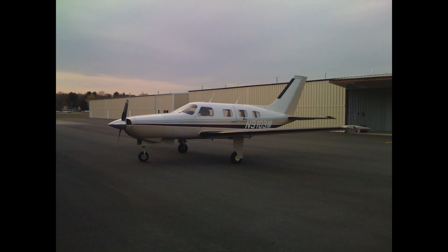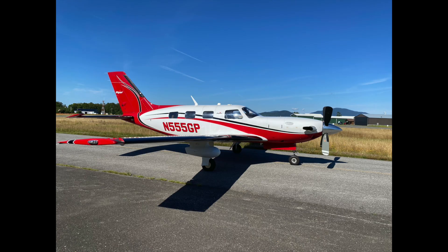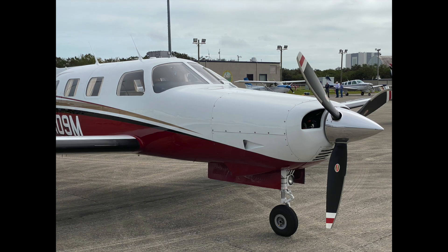In this video, I will describe what PA-46 pilots need to know about the nose gear. All PA-46 models have the same nose gear design, so this video will be useful for your model. PA-46 aircraft have been involved in a number of loss of control incidents on landing. In some cases, the problem was attributed to damage to the nose gear from towing, or perhaps to lack of proper maintenance of the nose gear mechanism. These problems were not discovered on the pre-flight by the pilot.